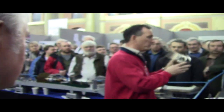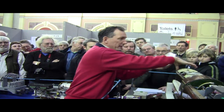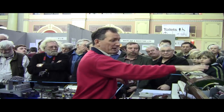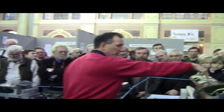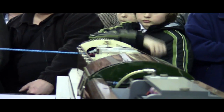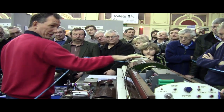So what we've got here is exactly that arrangement — gas turbine, free power turbine, and gearbox — configured as a turbo prop, but we've taken the prop off and attached the remainder of the gears to this locomotive. It goes through belt drives, then some bevel gears which enable us to have forward and reverse gear, then a chain drive, and a final belt to the driving wheels. This wheel here is directly connected to the wheels on the rails.